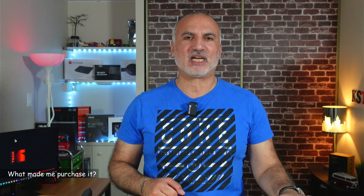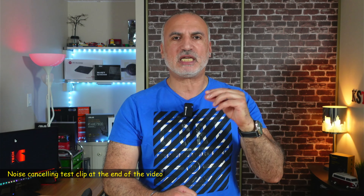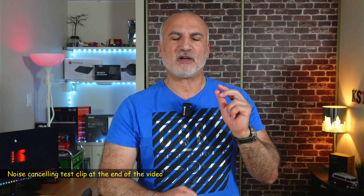At the beginning of the video, I mentioned I chose the Hollyland Lark Max Duo for three reasons: the equalizer, the ENC noise cancelling, and the internal recording. I'm totally satisfied with the equalizer — whether using hi-fi inside the studio or vocal boost outside. The noise cancelling is also very good, blocking ambient noise about 99% of the time including wind, though I find it slightly too intrusive. For internal recording, it works really well but I had to set the gain to +10 dB to get a usable sound — likely a safety precaution to prevent distortion from loud sounds.